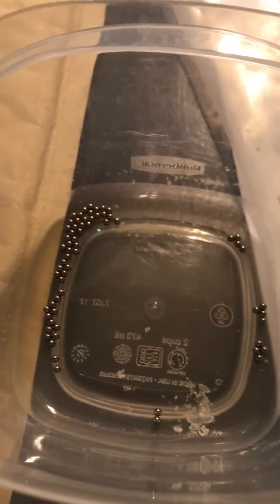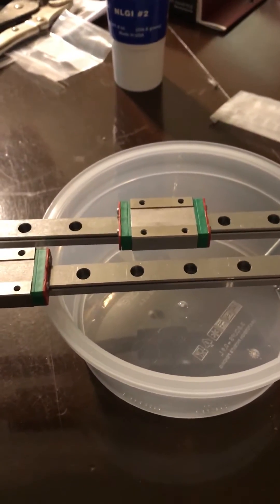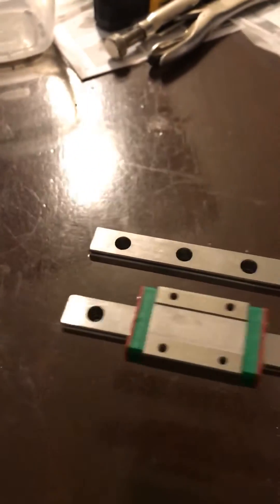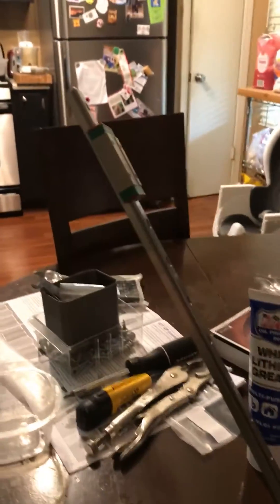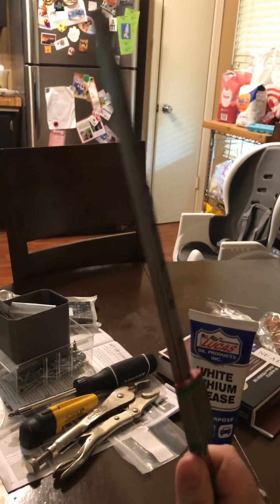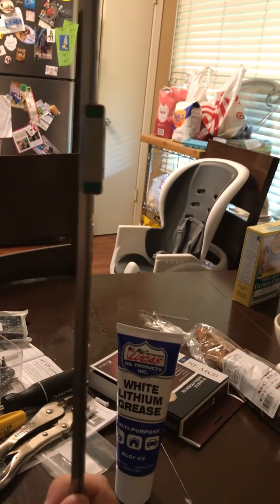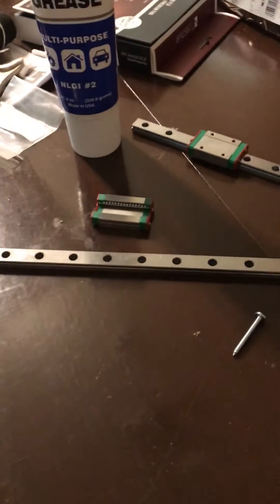I can't tell too big of a difference by sheen alone, but I just finished replacing one set of ball bearings on one rail and it made all the difference in the world. I didn't touch the rail or add grease - all I did was swap in more precise ball bearings. This is how it came: I hold it nearly vertical, shake it, and it barely moves. But the one I've already replaced just flies right off - I lose control of it that easily, it's so smooth.